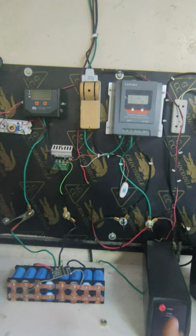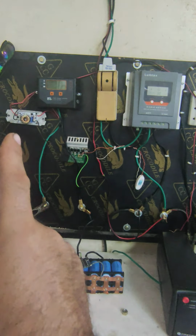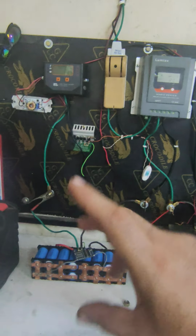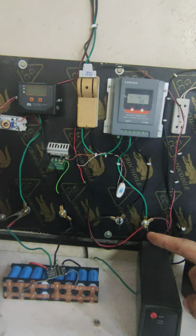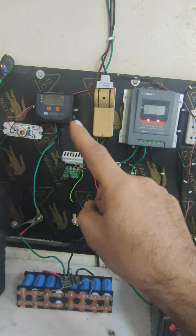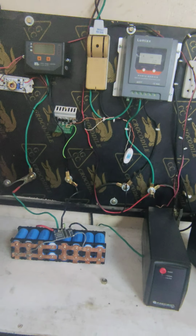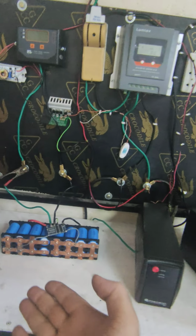I'm using this system in a critical situation, because my inverter was burned and I'm still upgrading the system, and I'm making a portable solar chargeable light. So this is a temporary design. I'm just testing the cells and the system line. Otherwise, I also have a lot of losses in the line. You see, a single line input comes, the charge controller, then goes to the battery, then from the battery I take this wire and go to the boost module. Here there are losses, then it goes again, the voltage is raised and regulated, here there are losses, then it comes to charge the battery. So this system is not sufficient, but it works for me because I only have a consumption of lights, and I need a lot of lights at night. So this is my home system running through this DC and AC lights.